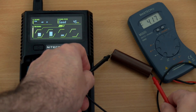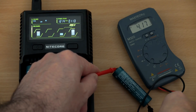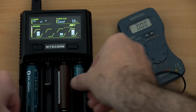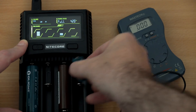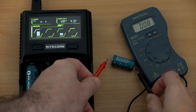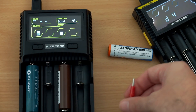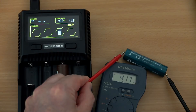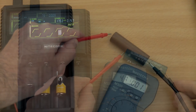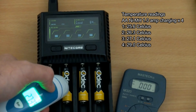Testing termination: the LGC cell measured 4.17 volts, and the Olight cell also 4.17 volts — so the display reads 4.2 but actual voltage is 4.17 or 4.18. This is the same on the D4 and not uncommon — most manufacturers target slightly below 4.2 volts for safety reasons. Looking for above 4.15 volts, all tested cells came in above that threshold, with readings ranging from 4.16 to 4.18 volts, so nothing to complain about for lithium-ion charging.